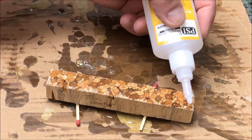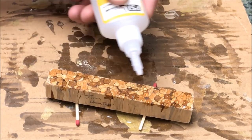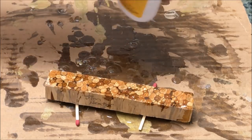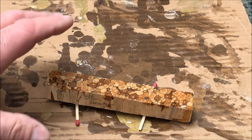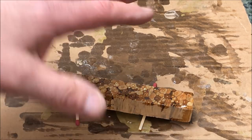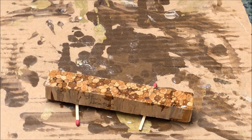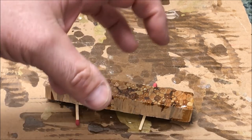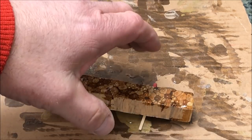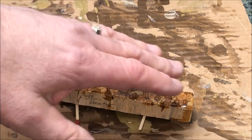It's really drinking that CA glue. I don't like to use activator when I do something like this — I like the glue to be able to soak into the blank as much as possible and dry naturally. It's going to get deeper and solidify all of those pieces together. So I'm going to walk away and leave this.